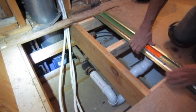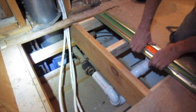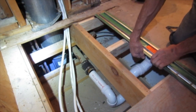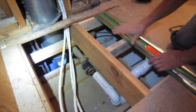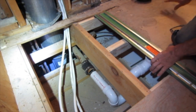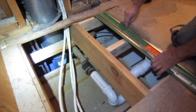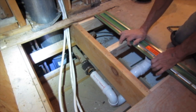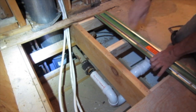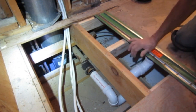I've got the coupling. Make sure you have a little bit of wiggle room once you've made your connection, because you are going to slip your backer board underneath here and underneath the front edge. There's going to be radiant floor in the rest of this bathroom. I'm still going to run my hardy backer out to about here so that I've got a nice solid surface, put my radiant up to that and run my wires around. So I'm ready to make this connection.